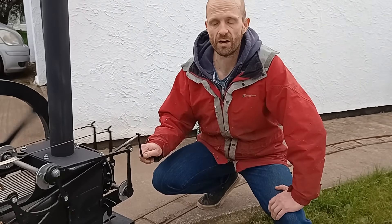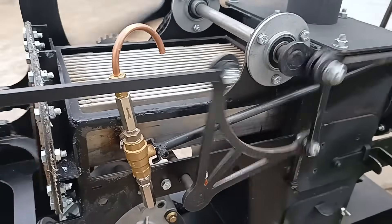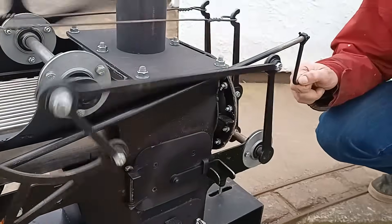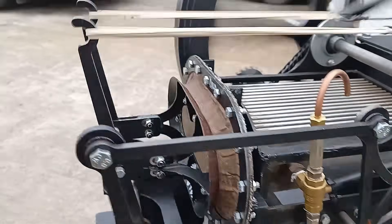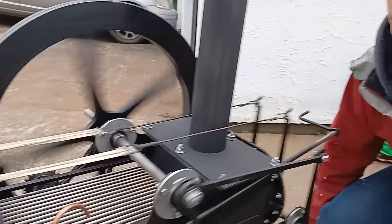I'm going to try the stop valve again to see if it works this time. I'm moving the stop valve — it's stopping the air sucking in and exhausting all the air it can through the one-way valve. The engine has technically exhausted all the air it can, but it's still not stopping. I imagine at the moment it's running on a partial vacuum cycle — you can hear the flapping of the diaphragms, which I think is because it's under vacuum.